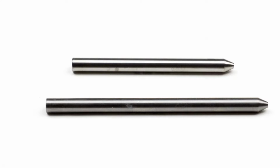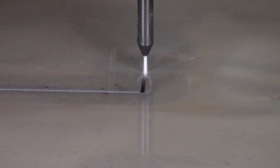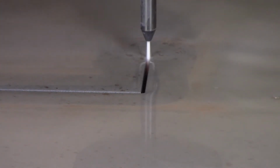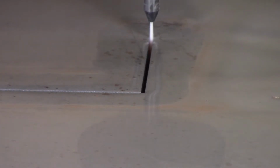Nozzle bores will grow after use and are no longer effective at keeping a coherent stream for optimal cutting. Nozzles will vary in the size of the bore and the length. Typical ID sizes range from 20 thousandths to 65 thousandths in precision application. The material that is used will also vary depending on the quality of the nozzle chosen.